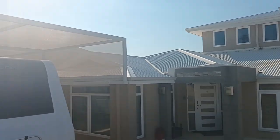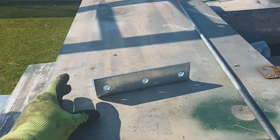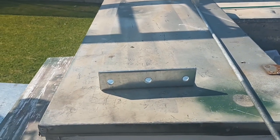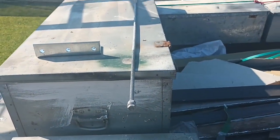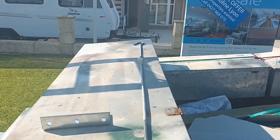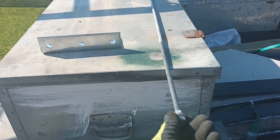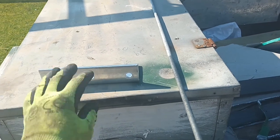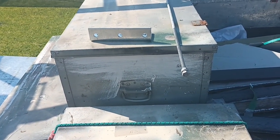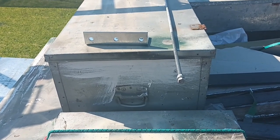So we're going to put some big rods in down the wall. We're going to take this plate, bolt it to the rafters, and then take that rod and put it down a wall, hook it onto a piece of 12mm rebar and go through these holes and hold it all down. Then we're also going to triple grip every other rafter.